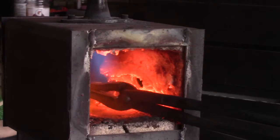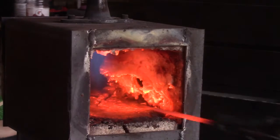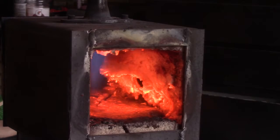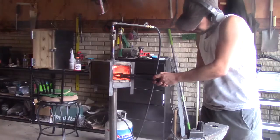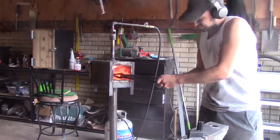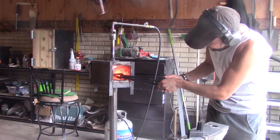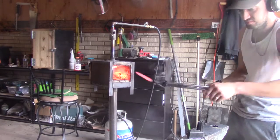Chisels are going to have tool steel. I've seen some that are 1095 and around that, so I'm going to just treat it like 1095 steel. I did three thermal cycles and I've got oil preheated to 135 degrees.